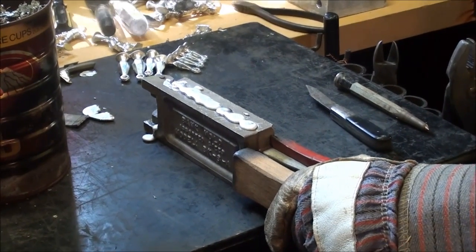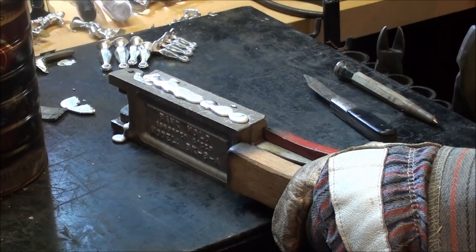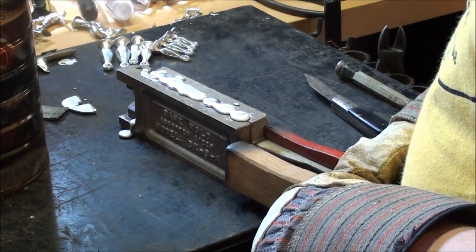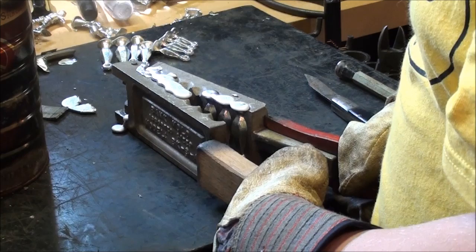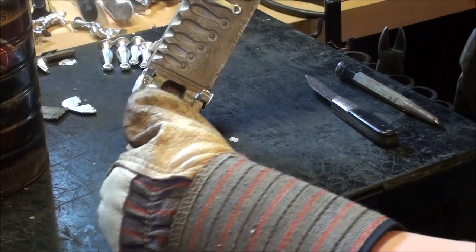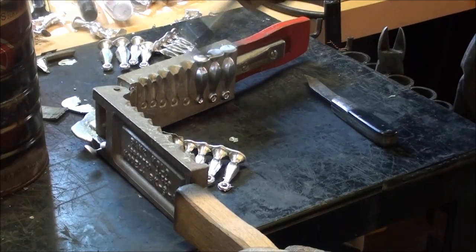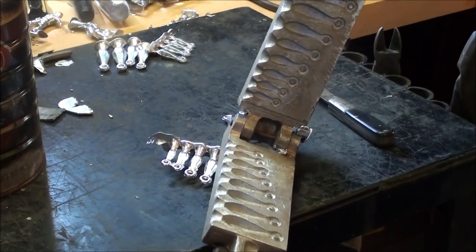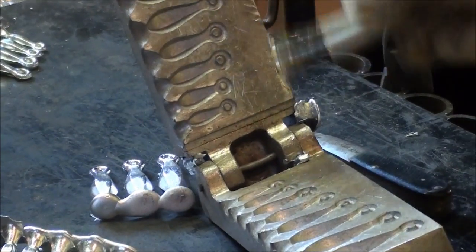It's ready to open now. You can watch as the metal crystallizes — it's interesting to see. Open it hard, Jordan. We had a little metal spillage on the far end, but it's going to open. All the sinkers came out — really good. Tap them out of there. They fell out easily. There's no carbon black on this mold — a little bit of metal caught in the hinge which we'll clean up, then do another batch.